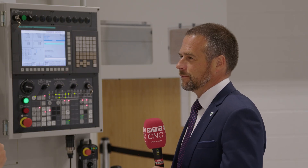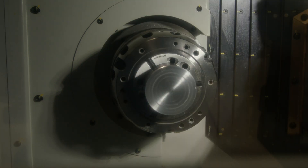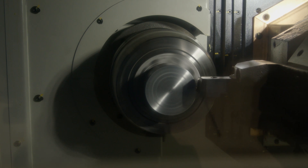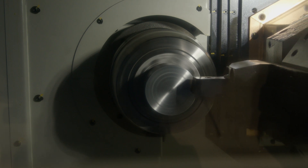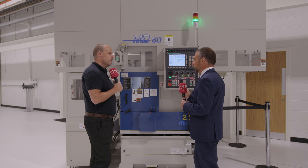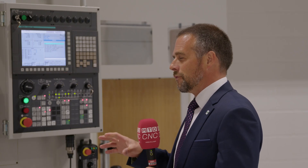The spindle faces the operator rather than running horizontally through the machine — this is a very old, well-tested parallel spindle design that Murata started with. It's a very stable process: accuracy and repeatability are excellent, and because of the spindle and turret configuration you see very little thermal growth — maybe just a couple of microns from cold to warm.